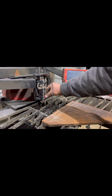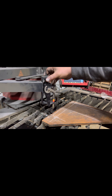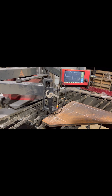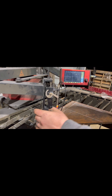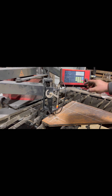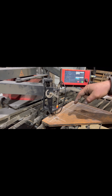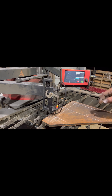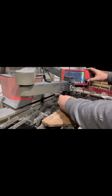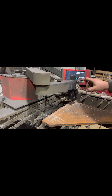This thing has a button right here on the stylus, and this button on the little computer it comes with does the same function. So I'm going to come right here, find the center of my first hole — right there — and go ahead and click. I want to do a one-inch hole, it's already set there with an inside cut and a half-inch lead. The lead is where it pierces the material, and I like to do a half-inch on this thicker plate because by the time it pierces and gets to where it starts the circle, it's already got a good cut going. We've got our circle there.